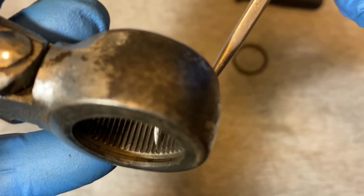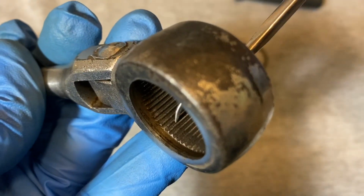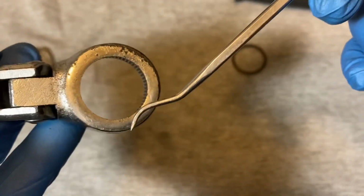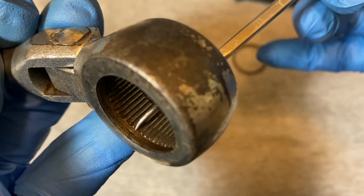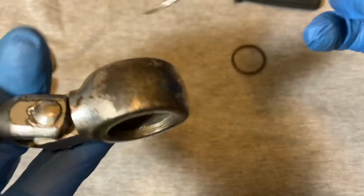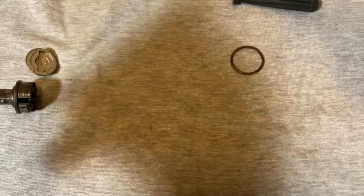But the teeth on this end over here seemed a little bit kind of worn down, but I won't say this is 100% from the factory. I've seen other ratchets that were pretty new that had a good amount of worn teeth back here. But this one I'm on the fence with because of the use, and we'll get into other stuff when we look at the pawl. So all in all, like usual on the New Britain, very good broaching.